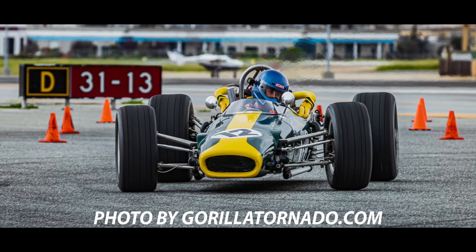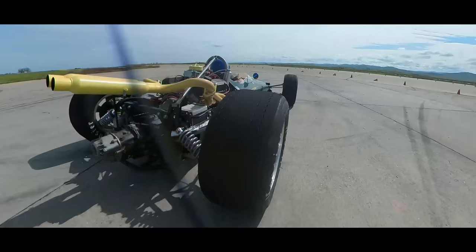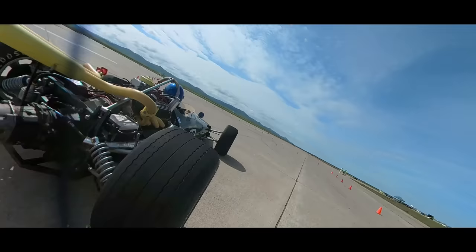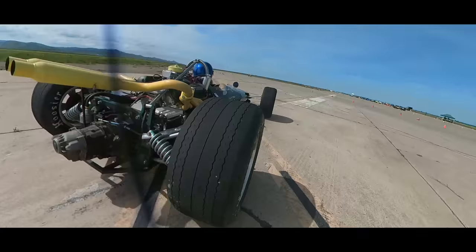The whole car with fluids and everything weighs about 1,400 pounds. It's a Ford 302 — I got it from a guy who had it in a Cobra replica and was stepping up to a stroker motor. He took the top of his engine, put it on the stroker short block, and gave me the short block. I put on aluminum heads, intake manifold, headers, and carburetor. The gearbox is an Audi 016 out of an Audi 5000. Like the engine, I got it from a guy who had a GT40 replica, so I got it with the adapter plate. The rear suspension uses Ford late-90s T-bird knuckles, which a lot of guys building Cobras with independent rear suspension were using.